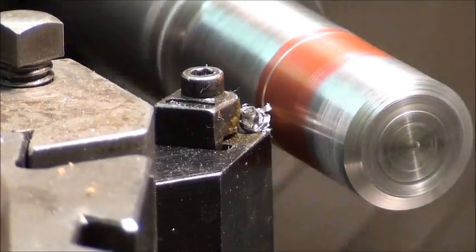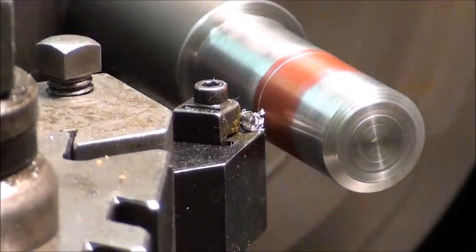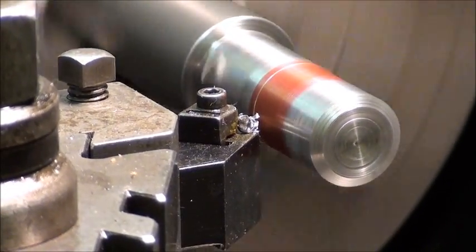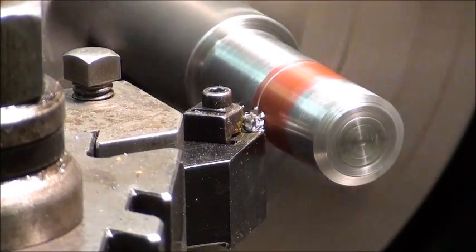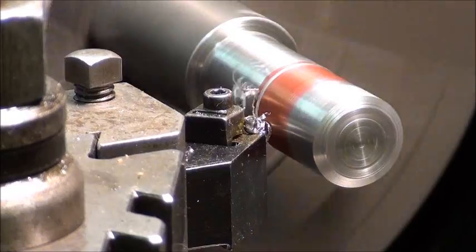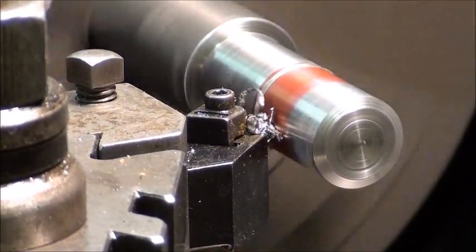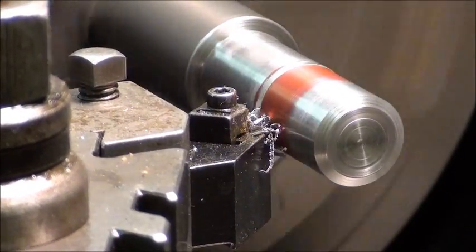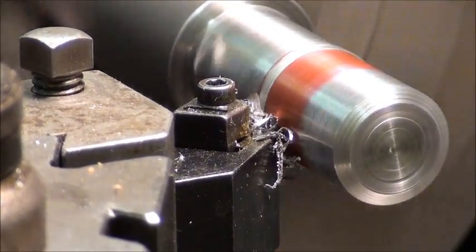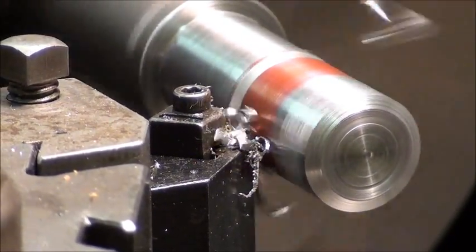I can't just come out at the very end of the thread each time, so all we do is we put a groove — or a radius groove — or something that I can escape into. I've taken it to exactly an inch, and all I need to do is plunge in. I'm guessing because, to be honest with you, right off the top of my head, I don't know how deep this thread's going to be. That's going to be enough, and then I'm going to move back towards the start of the thread.